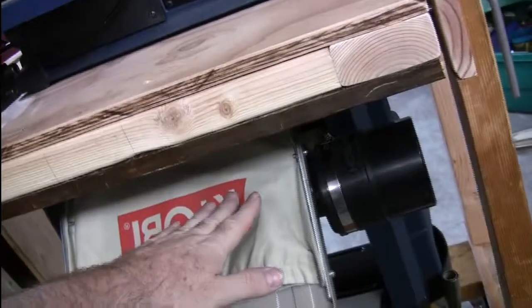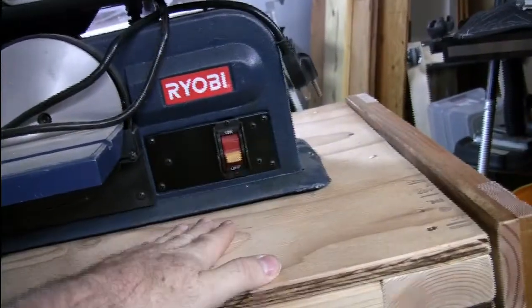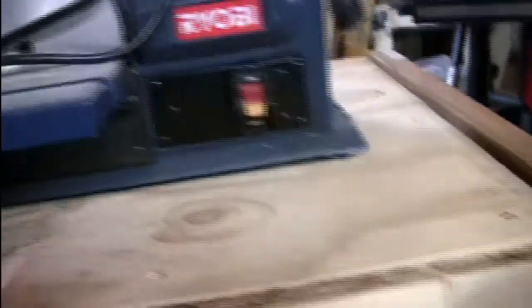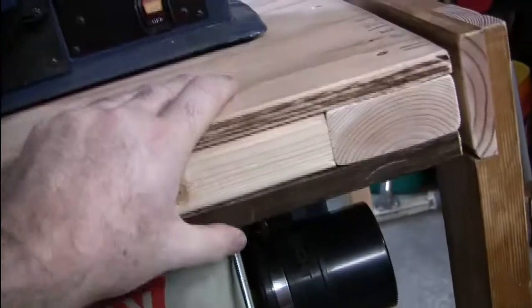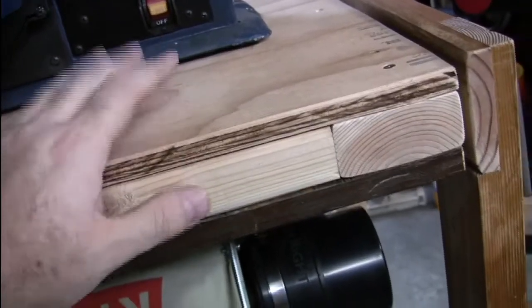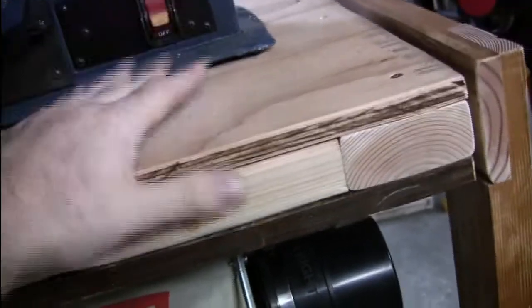I took the plywood off and drilled and attached the planer with bolts down through, using 3.5-inch quarter-twenty bolts. Then I drilled and attached the sander to the other plywood with 5/16-inch, inch-and-a-half or two-inch bolts, then reattached the plywood to the unit. Unlike my first flip top where the bolts go all the way through, the bolts terminate inside the open area behind the plywood — so to take the planer off I actually have to take the sander board off, unscrew it, remove it completely, and then I can get to the bottom of the bolts for the planer.